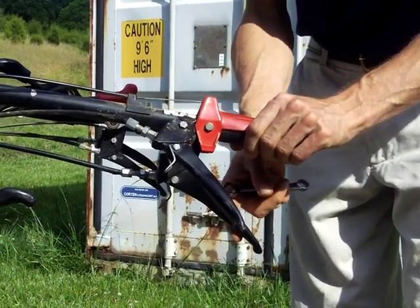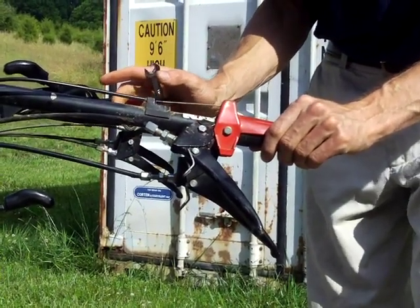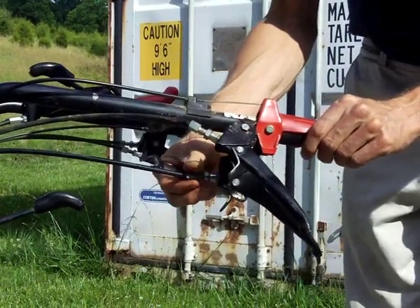Because this is the equivalent of riding a truck or car with your foot on the clutch pedal. It's going to keep the clutch plates from fully mating. So you don't want to do that — you've got to have some slack in the cable.